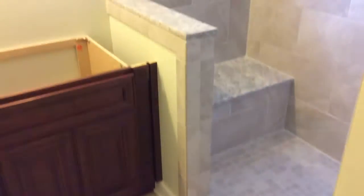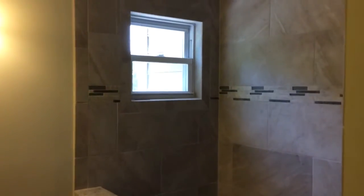The cabinets down here are custom — you don't see this kind of stuff every day. They're double fluted on the sides with beautiful detail in the doors. Most people would run scribe mold up against the wall, but not us — these are full extension all the way out. They're dovetail construction with full wood edges and soft-close as well. They put a rosette at the top just to cap it off beautifully.